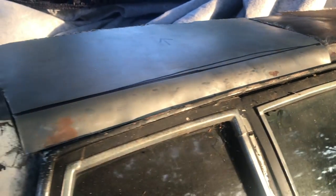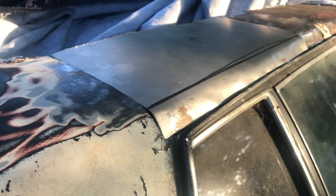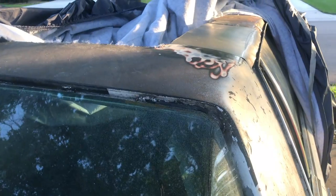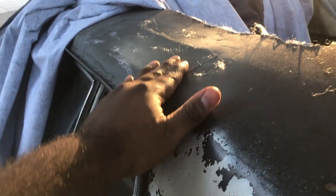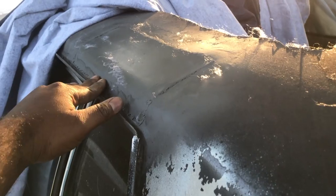As you can see, it's pretty much where I want it — always that one corner I gotta fix, but I've been working on that. The driver's side I just got in primer right now, so you can see how that's looking. We're gonna fill that in; I still gotta grind this down, take the welds down a little more, and then go ahead and put some filler on it.